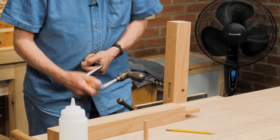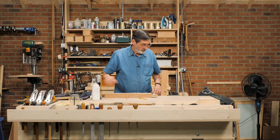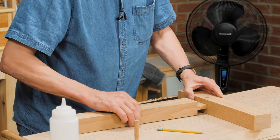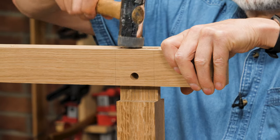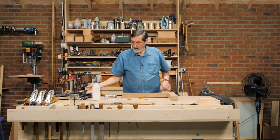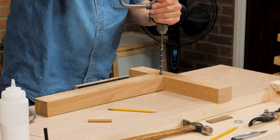This is a neat concept — I don't know who came up with this idea, probably millennia ago. I'm through that first one, and now I want to put this inside here to get the position for the next hole. I just simply punch the surface hole here with the brad point of the drill, and then take it apart.